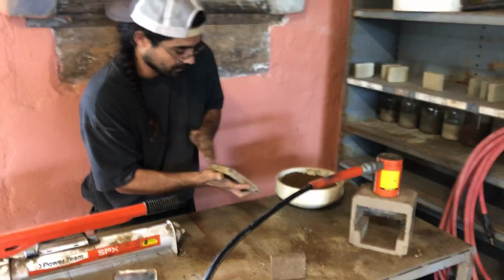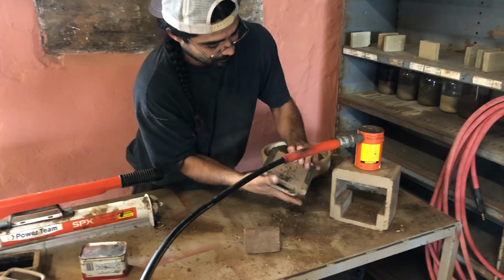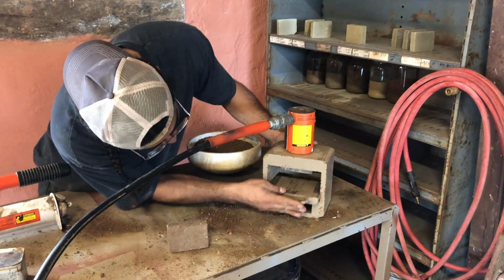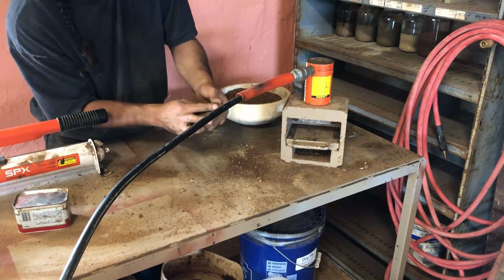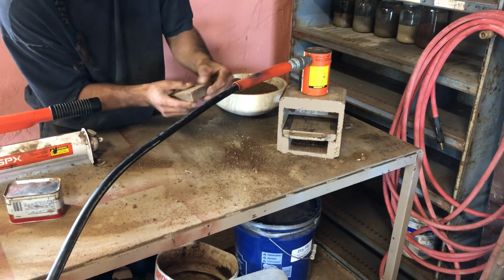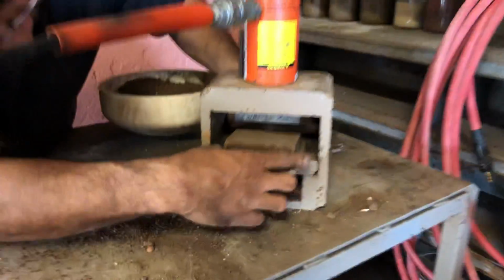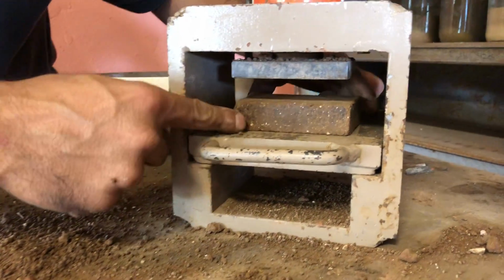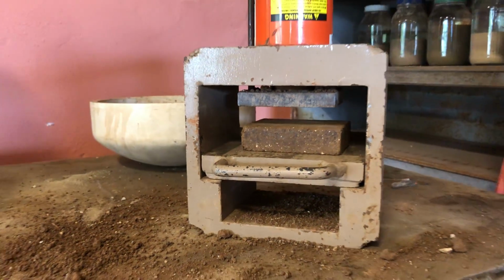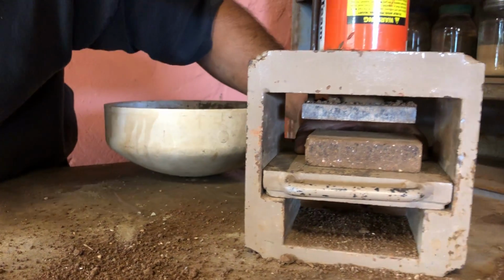So for this purpose, what you would do is you put your press plate in upside down, push it all the way in, make sure that your surfaces are clean with no bumps or raises. Make sure the plate's clean. And you will align the block with this plate here on top, the actual plate that slides in that form. So slowly, slowly, ever so slow.